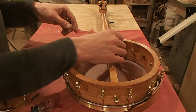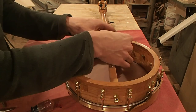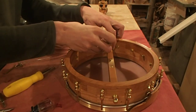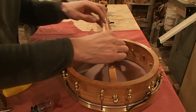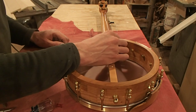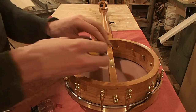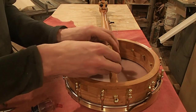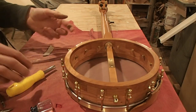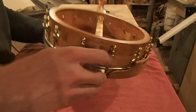Then the plate goes on here, then the yoke goes on, the pin goes back in. Sometimes you've got to wiggle them a little bit, or move in from one end or the other. Then just finger tighten this bolt until it starts to grab. Make sure the pin is centered. Take your 5/16ths and just snug it up — it doesn't have to be super tight. If you over-tighten it, it'll just push the metal into the wood, and that doesn't really help. So just kind of snug.